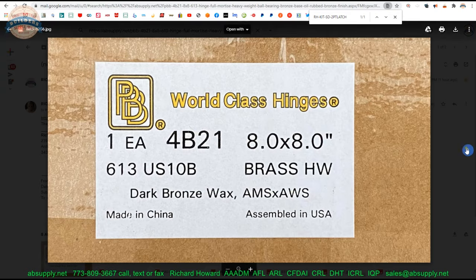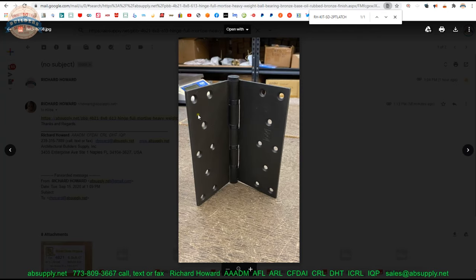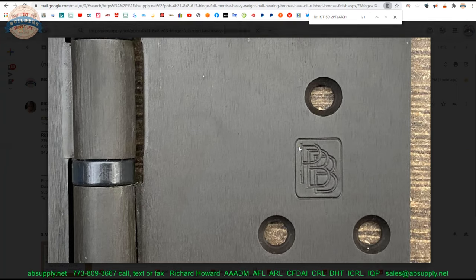We're going to dissect that part number again. That's what the hinge looks like standing up, folded down a little bit. You can see there's a brown or bronze tone there. An end view shows that it's a full mortise hinge, evidenced by the swag on the hinge leaf — the fact that the hinge doesn't lay flat on the table makes it a non-full-surface hinge. As for the logo, I don't love the size of it — I would prefer it to be about half the size. I don't really want corporate advertising on my hardware.